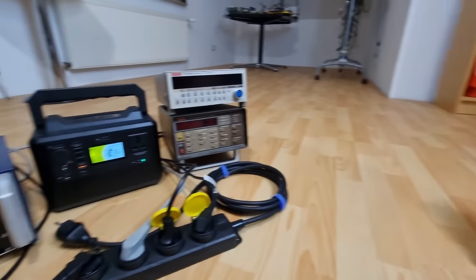It didn't quite behave the way I had hoped, because a few minor mistakes slipped through the last revision. Nothing a bit of mild superficial rework couldn't fix. Now it gets the same treatment as the previous DC-to-DC converter — first a horrible mains power supply to estimate the attenuation. It's also in the 30 dB neighborhood. I wonder if the transformers are so good that my PCB clearances are becoming the limiting factor — I'll try to add more in the next revision. But for now I'm getting 24 nA RMS out of this super cheap and simple construction, if it has a somewhat decent mains power supply before it. That is much better than I had hoped to achieve today, so I'll gladly submit that as my result to the list.